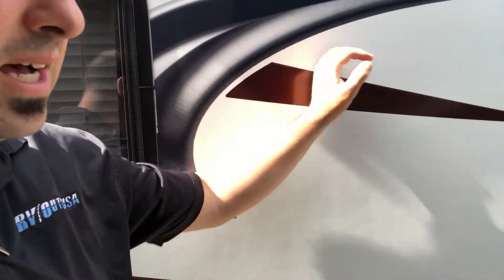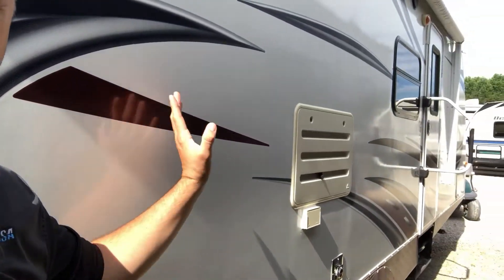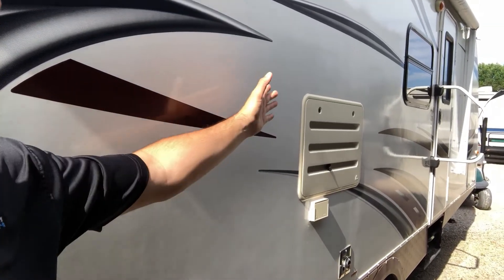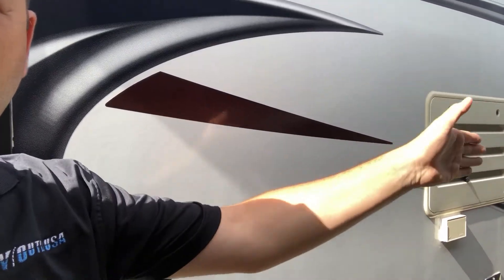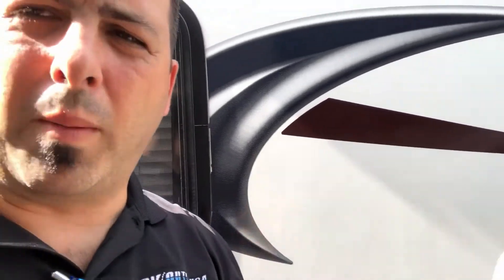So that's one of the things you have to look for. When you're looking at an RV, you want to tap the side — if it's solid, good. If you look down the side of this RV, it's nice and smooth, you see a nice sheen at a 45-degree angle and no waving at all. If it has a wave or a bubble effect, it's had water in it — 95% of the time it's water that caused that.